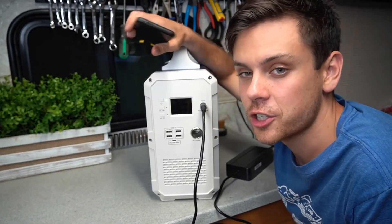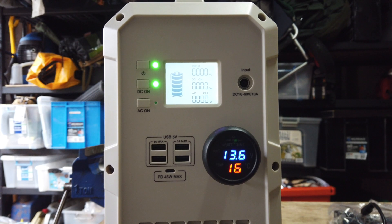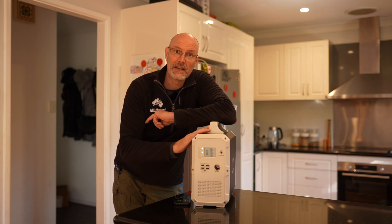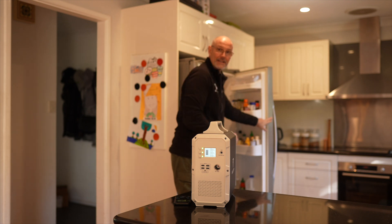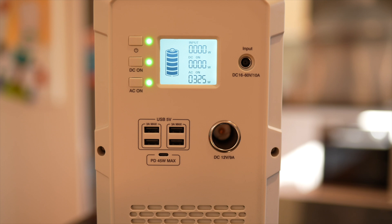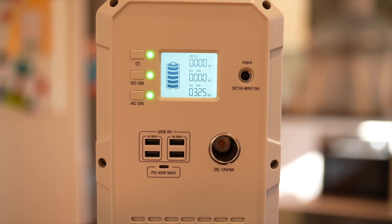In Will Prowse's video, the front 12-volt cigarette lighter also only provided a regulated 12.3 volt, which is very low. However, this has also been addressed, as I had a constant output of 13.6 volt, which will be no issue. One other thing I wanted to test is how well the EB150 would work as a power backup device at home — for example in case of a power outage. So I rigged an extension cable from our fridge, plugged it into the unit, and it's drawing around 327 watts for a big fridge-freezer combination. Depending on the outside temperature and how often I open the fridge and freezer, I reckon I can run that unit for many hours on the EB150.